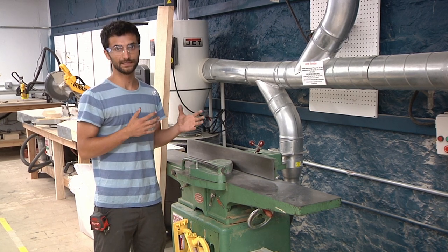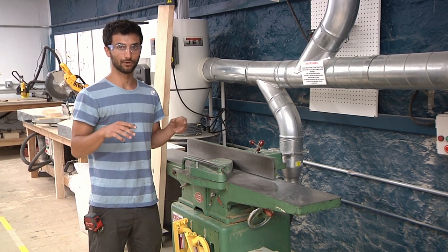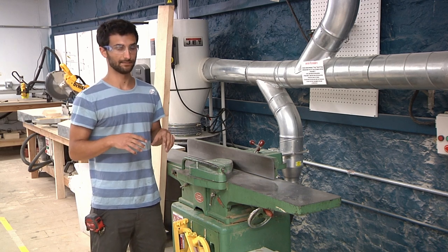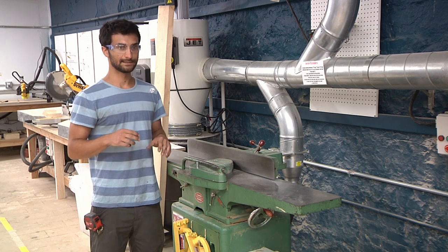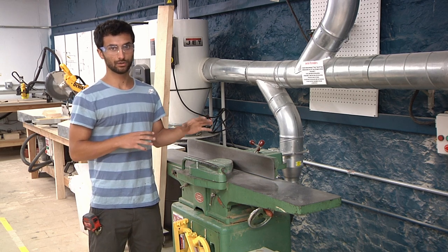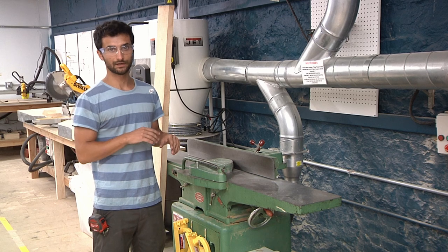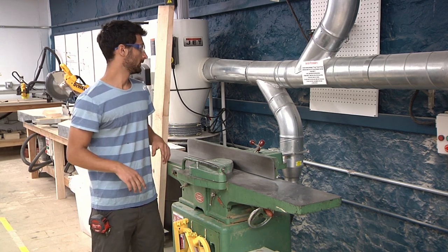The only time you would take a 1/16 is in a soft wood that was clear, meaning there are no knots in it, or spots, or checks, or cracks that look like they may give you trouble. And so in general, I take a 1/32 of an inch off at a time. That's a fairly safe amount. And if it's a very hard wood with weird stuff going on, you might take off even less, just to shave it off. There's no rush. It'll take you slightly longer. It's not a big deal.